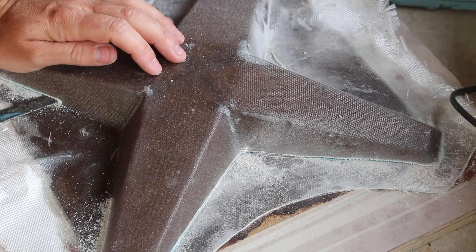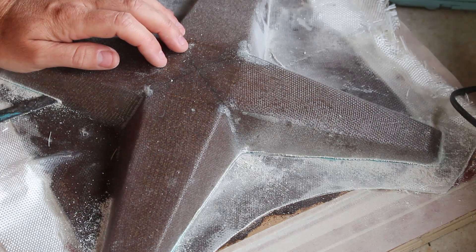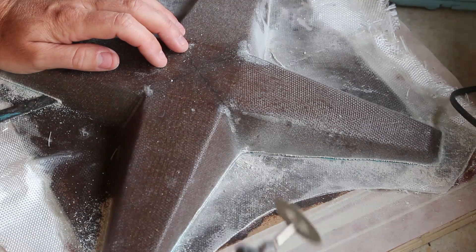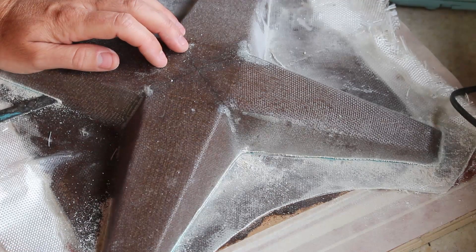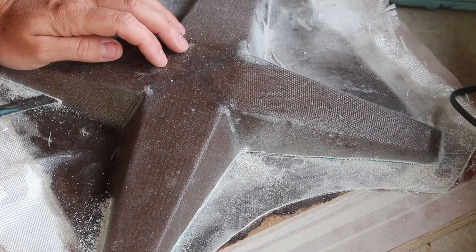This has set overnight. I have to be honest — I didn't put enough hardener in the resin so it's taken longer to set than I would have liked. I'm now in the process of cutting the fiberglass from the baseboard. I started using a diamond cutter in a multi-tool but the multi-tool was getting so hot I couldn't hold it, so I'm now using a hacksaw blade, which is working quite nicely.